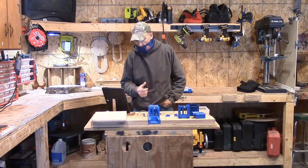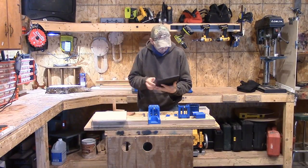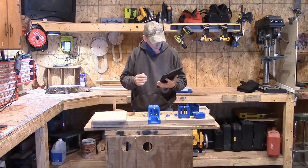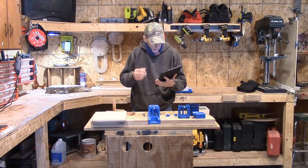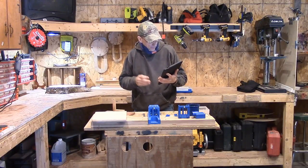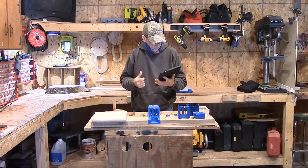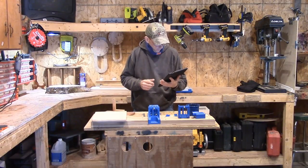The Kreg Pocket Hole Joinery System. What is pocket hole joinery? Pocket joinery is not new in the woodworking industry by any stretch of the imagination. The process is simple — it involves drilling out the correct angle hole to create a pocket. That pocket creates a channel or hole for your fastener to go into. It perfectly aligns your pockets so that the angles of the fasteners don't go through the fascia of the other piece you're looking to secure together, provided you use the jig correctly, which we're also going to show you how to set up and work with properly.